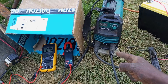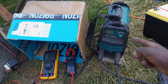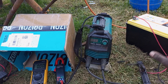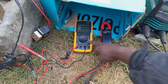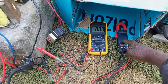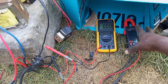I've got this inverter IGBT welder charging a battery with the knob turned to the maximum, so you're going to get the maximum power output going into the battery. There may be a lot of current but it won't run the battery for too long. This meter measures the AC current being delivered to the load from the transformers, and this meter shows the AC voltage and frequency in hertz, so we can see whether the PMG is going to slow down and how the voltage behaves.